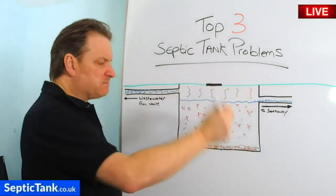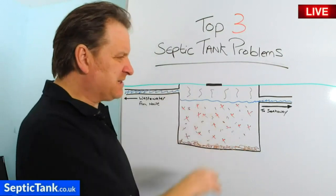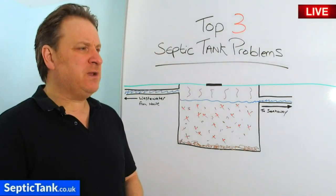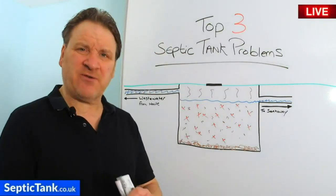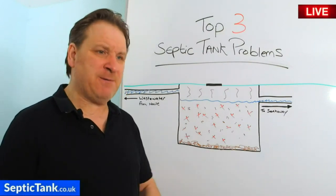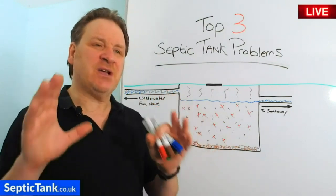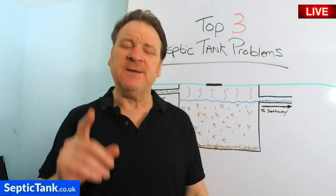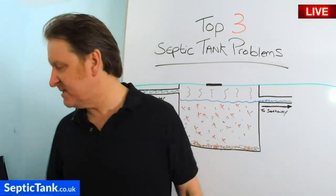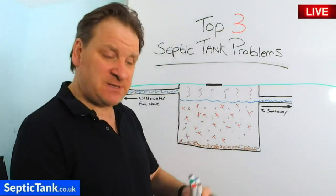So if your septic tank smells, it's because you're using too many cleaning products and it's killed the good bacteria in there. Now you're probably thinking, well, I've got to use bleach, especially with the coronavirus around. I've got to use bleach and kill all these bugs that are killing people and could harm me or my family. And I'm not saying not to use cleaning products, but there are normal cleaning products for household use that aren't connected to septic tanks, and there are cleaning products that are designed to be used with septic tanks.